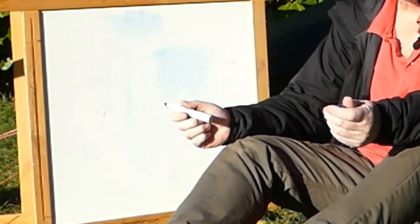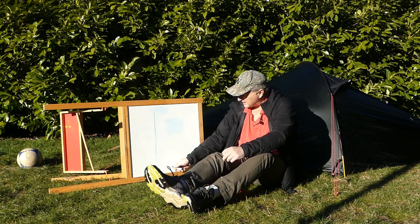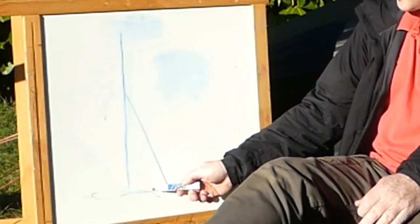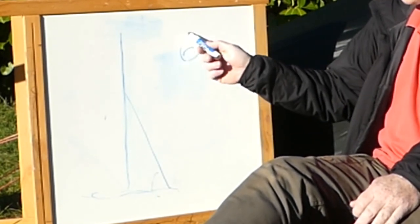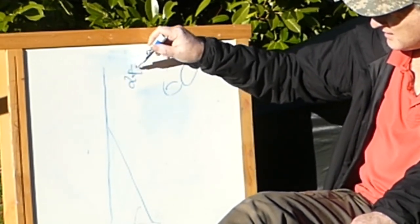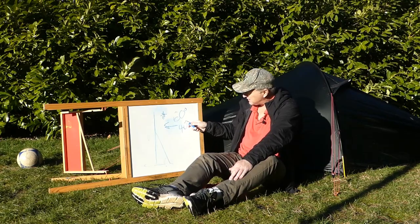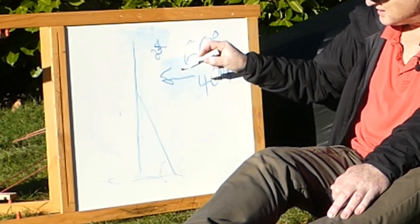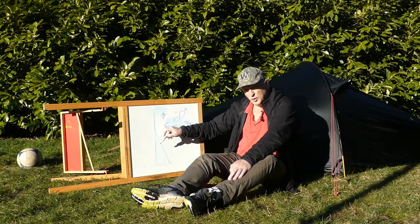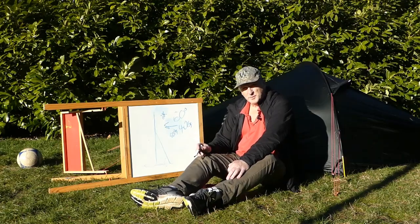I have a few friends that do the radio tower thing. If you have a radio tower, and you take a guy wire and pull it so the angle down here is 60 degrees, you've got two times the pressure going down as the pressure going sideways. So if we have 40 pounds of pressure pushing laterally with a 60-degree guy line, it's actually going to be pulling that pole down to the ground at two times — so 80 pounds of downward force.